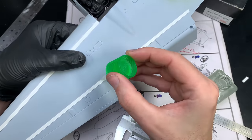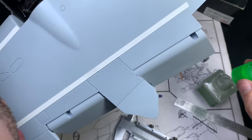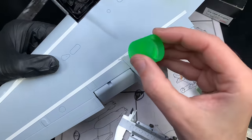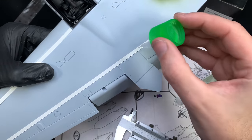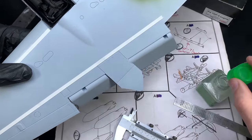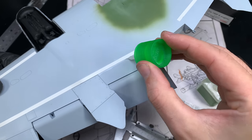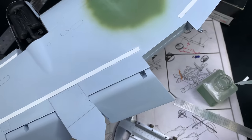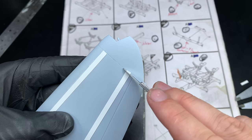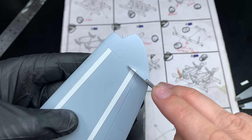And when it comes time to actually glue your strip down, I cannot emphasize this strongly enough. Use the glue sparingly. The reason being is because this strip is only 0.13 millimeters thick, and you will warp it and distort it and this, that and the other. Now, I'm also using the glue on both sides, just literally tacking it down and just leaving it like so. But some of you may be thinking, oh, you've left that a bit too long.